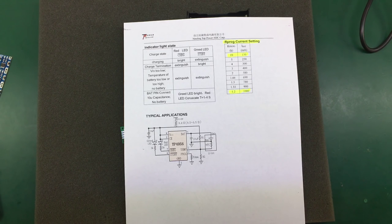We don't get the internal diagram of this chip so we don't know what's behind the programming pin, but just to be on the safe side I'm going to use a 500 ohm resistor to ground to limit the current that could go through that pin. You can use any value between 500 ohms and 1k. If you're interested in the performance of the TP4056, I placed a link in the description to a page where a guide does an in-depth analysis of this charging IC. There is also a link to the datasheet down below.